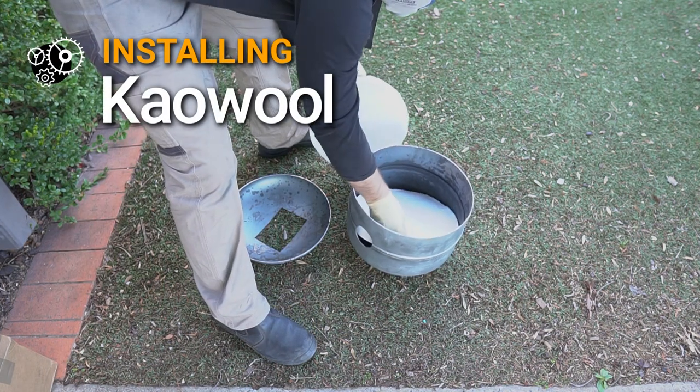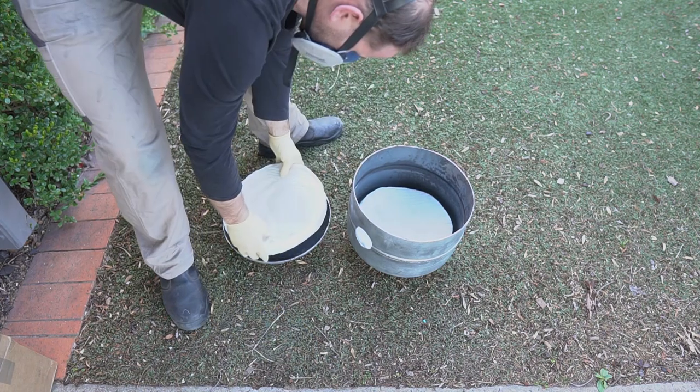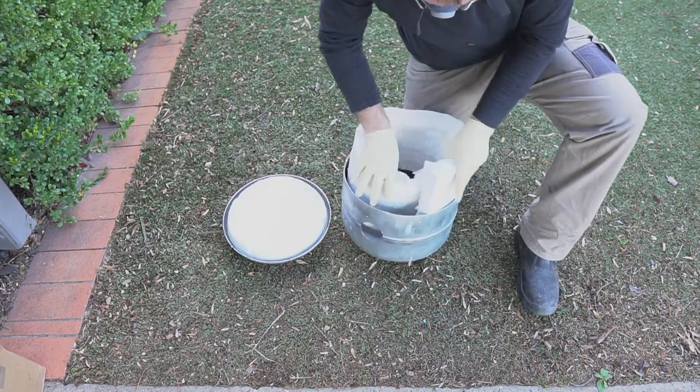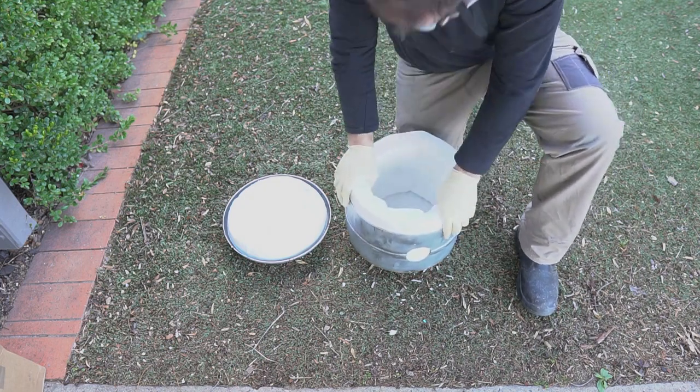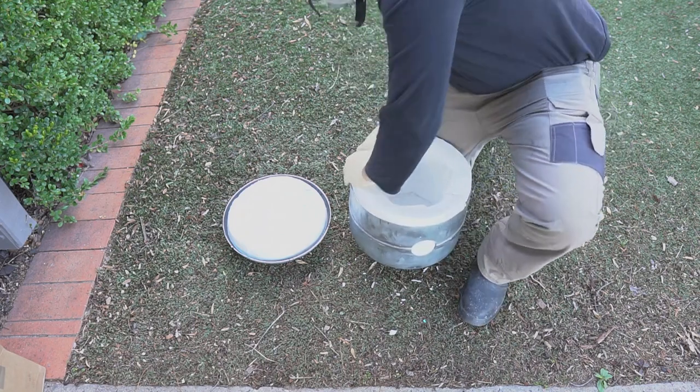The Gameco single burner forge kit is an affordable way to build an effective forge. The kit has just the right amount of materials to fit inside a 9 kilo LPG bottle. Start with the ends, and then wrap the center section around so both ends meet as neatly as possible.